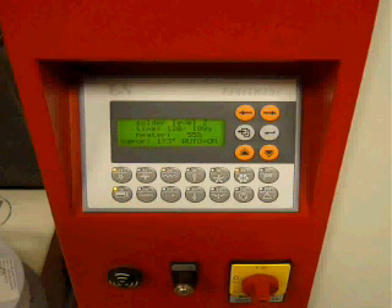This is just a quick view of the machine controller. It's a PLC based system with an intuitive button based interface. The system actually comes with an integrated chiller for the purposes of cooling, so it could literally be rolled around the shop floor and taken to places where it'd be easier to reflow the product than bring the product to the reflow machine.